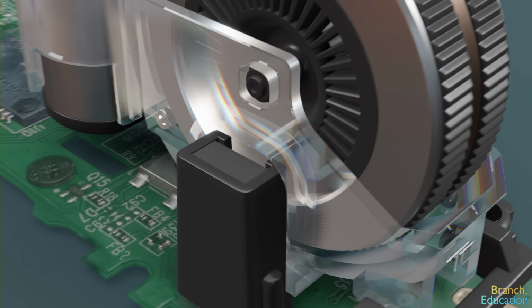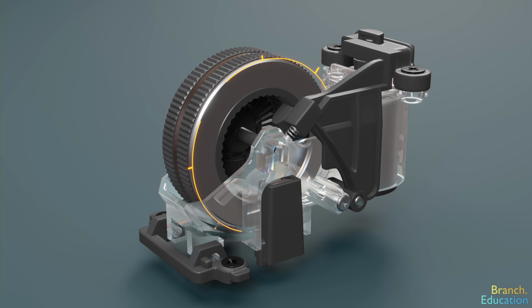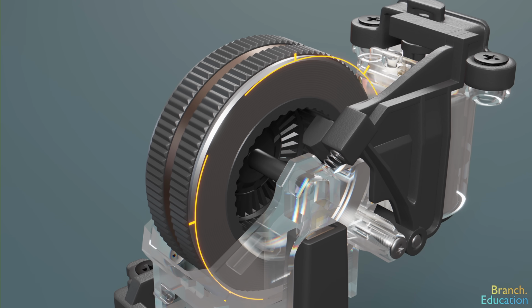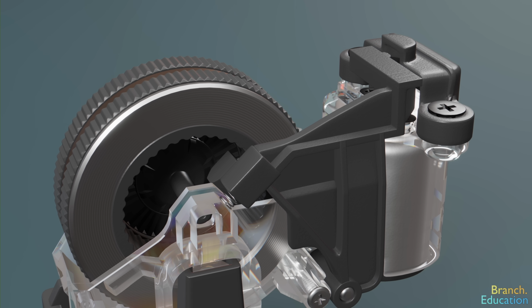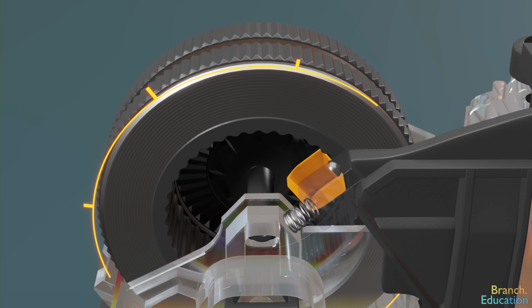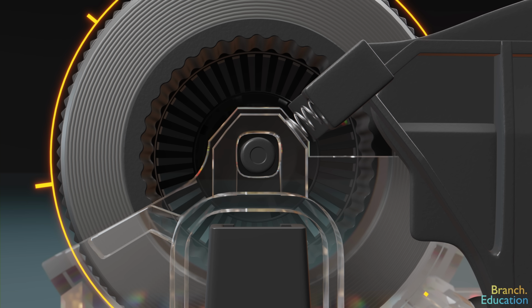Most scroll wheels have some type of mechanism to create the clicking-like motion and sound as the scroll wheel rotates. A common way this is done is to have a ring of ridges, a spring, and a small plastic follower that rides along the ridges. When this button is pressed, the motor turns and rotates to engage the follower so that it presses against the ridges. As you rotate the wheel, the plastic moves up and down the ridges, thereby creating a stepped or chattering motion. And the spring applies a very light force so that the plastic follower stays in contact with the ridges.